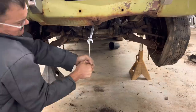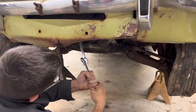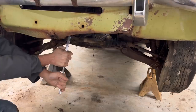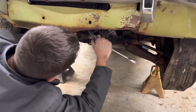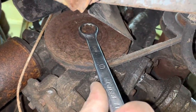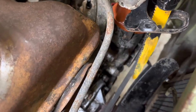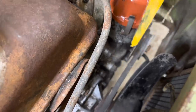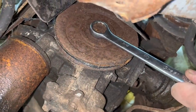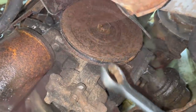What was that? What's scraping? That's weird. It's like it turns easy in some spots and then it gets stuck again. I just noticed — look, it's a bolt turning. That's not good. I'm going to cut the belt off this thing because just in case the generator or the water pump's stuck. Look how stiff it is. Still stuck the same way it was. That wasn't it. Let me get the breaker bar if it'll fit.